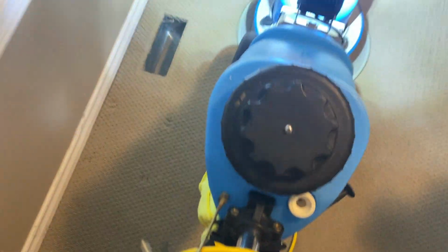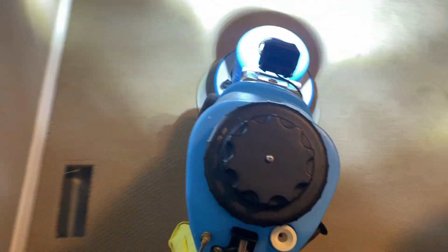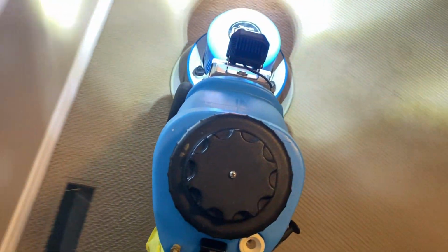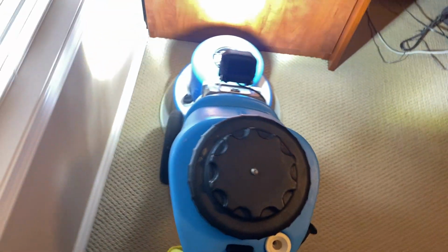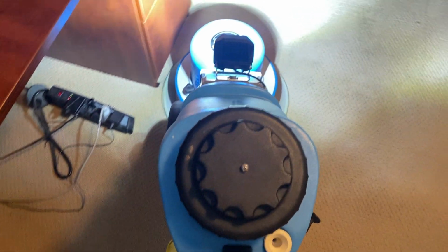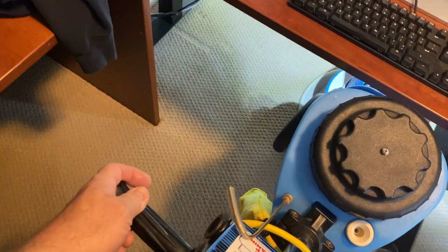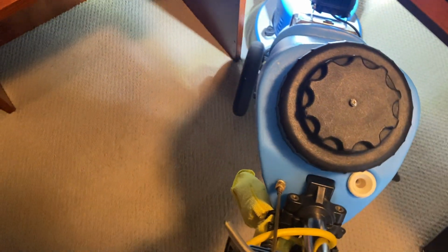Oh yeah, that's better. That's much better. I want moisture to be definitely felt on the carpet, but there's a balance that you're after. If you get it over-wet, even though you're using a pad system, you can actually wash dirt into the back of the carpet, and that's obviously not a good thing. On the other hand, you could run so dry that you actually risk tip wicking.